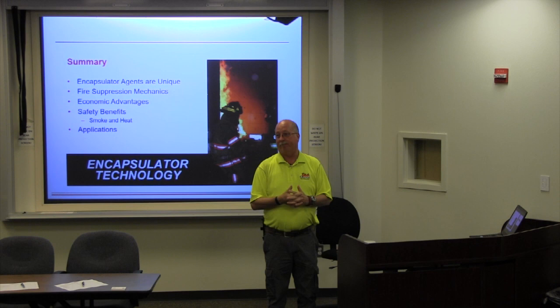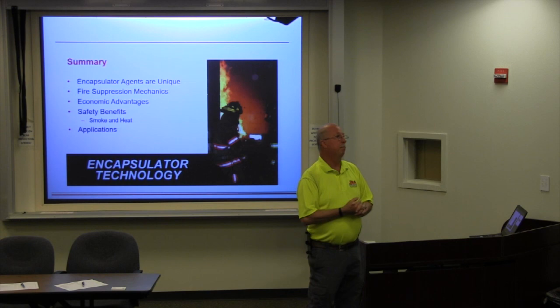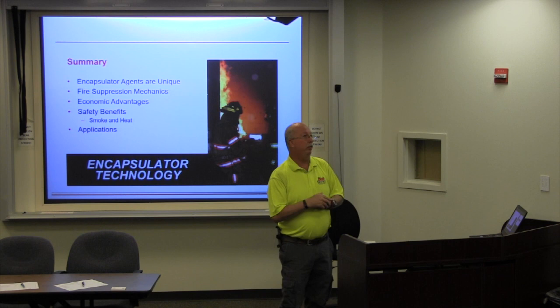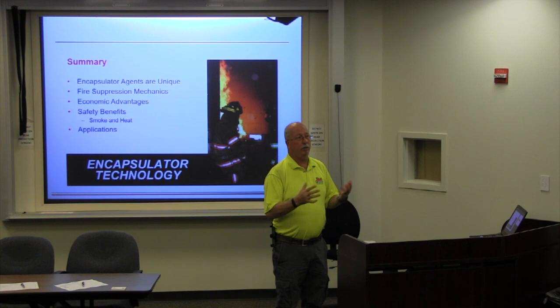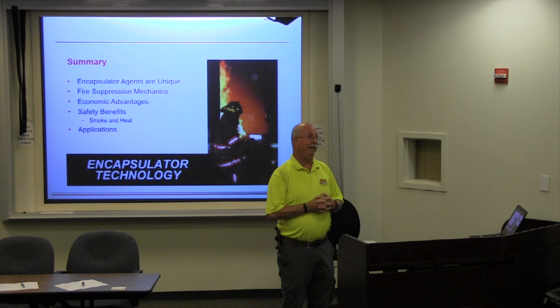So on a spill, the recommended practice is to extinguish with the F-500 and then come back with foam. If it's a really large spill, I mean, once the fire's out, I've done my job. You have that 9,000 gallon spill, that huge spill that's on fire and burning. Once I've put the fire out, unless you want to use 3,000 gallons of my concentrate to encapsulate 9,000 gallons, I'll deliver it myself.